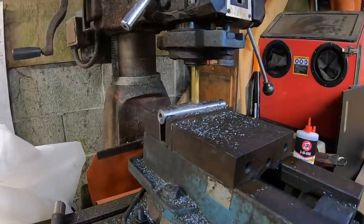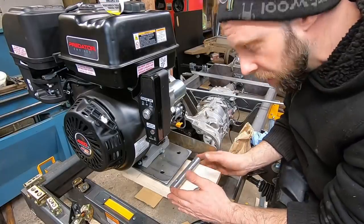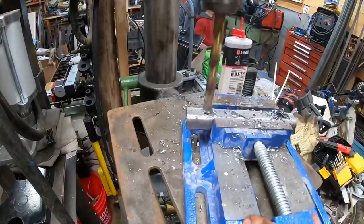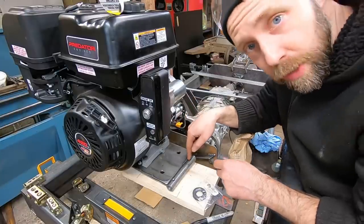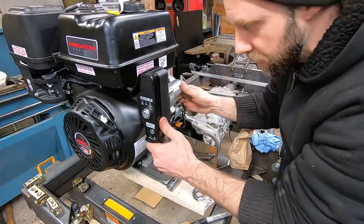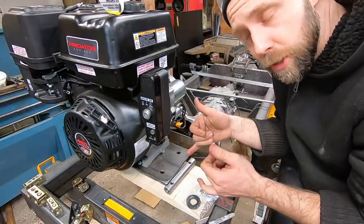All right, you guys, so here's a little shaft I built, and it's actually gonna hang off of some frame supports right here. It's drilled and tapped on the sides and in the centers. It's gonna sit underneath this plate, and there are gonna be some pusher bolts that hook into it to raise and lower the motor. The reason I'm gonna make the motor pivot up and down a little bit is it's gonna be a much better system for tensioning the chain on here.